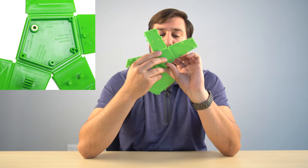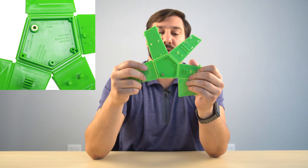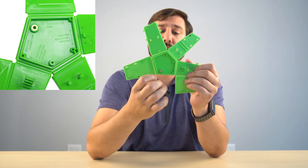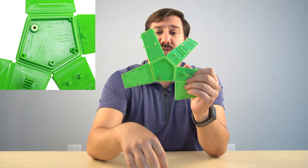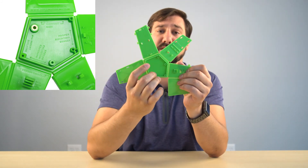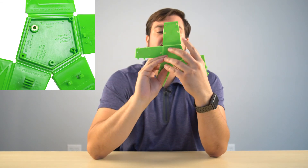Finally, here at the bottom is insert molding. Inserts can be placed in by being pressed in or heated in. But what's used here is the insert placed in the mold and the plastic flows around it, which actually fuses the plastic to it — it's created with the plastic at the same time. This gives you the most sturdy connection.